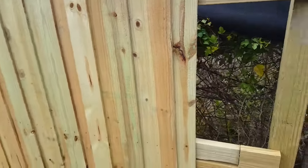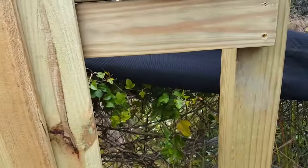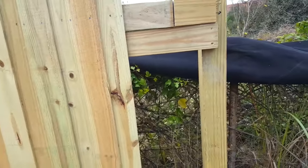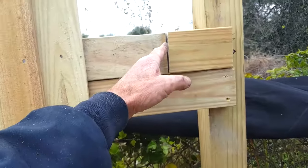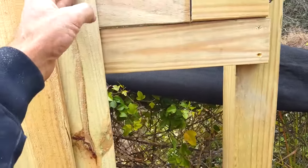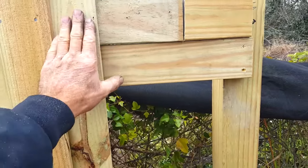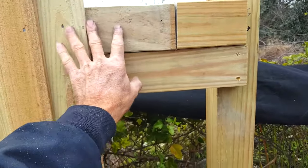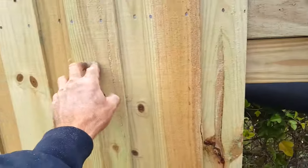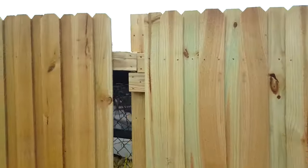That's how you can stretch them out. To shorten them, you basically just pry the pickets off. If your posts are not 96 inches or eight feet on center, pry the pickets off, cut the two by fours to where they are on center, and then go back in and fill in with your pickets — put another one two inches apart if you can, another one in the middle — however you need to make it look right, to match up and cover what you've got.